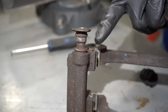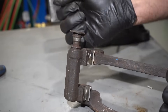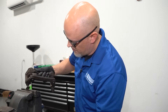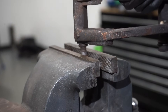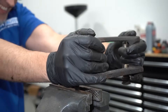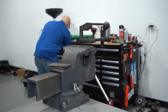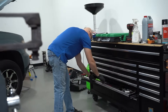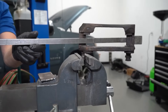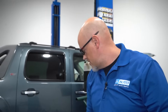What you could do is take some rust penetrant and just soak it. If you have the ability to soak it for a couple of days, that would be ideal — soak it every night before you go to bed. But obviously most of the time you have to fix it that day. So let's put it in a vise. See if you can move it at all. That's not working. So let's heat this up a little bit, see if we can get it to loosen up.